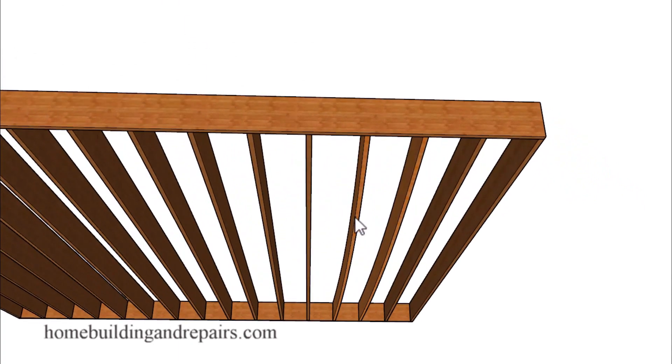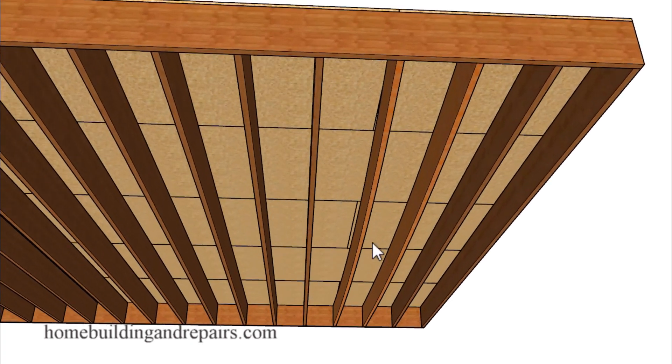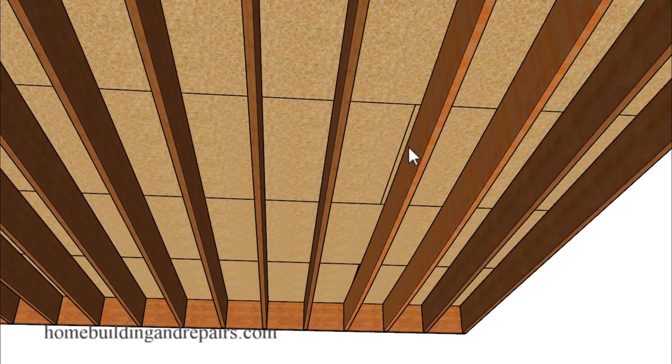The bottom is where you're going to be doing most of your work, unless you remove the floor sheathing and work from above. Next, let's go ahead and reinstall the floor sheathing where it would be located if the joist was not bowed, so you can start wrapping your mind around the problems you might run into if you're moving a joist that has a break attached to it on the floor sheathing.